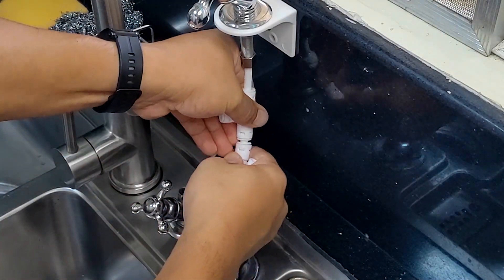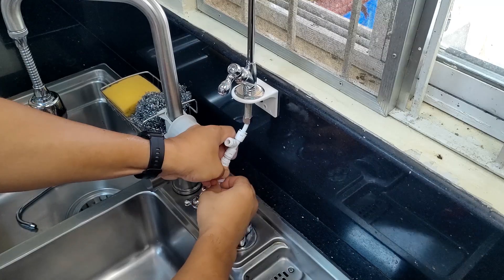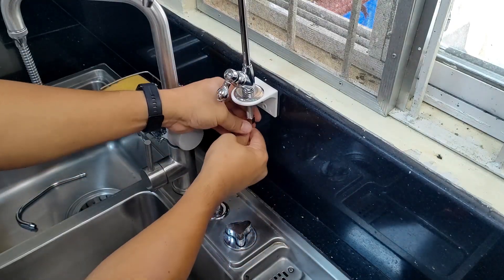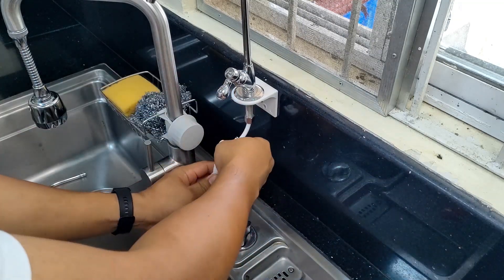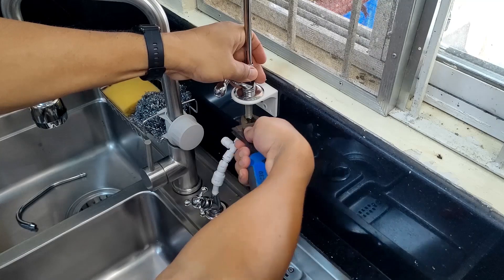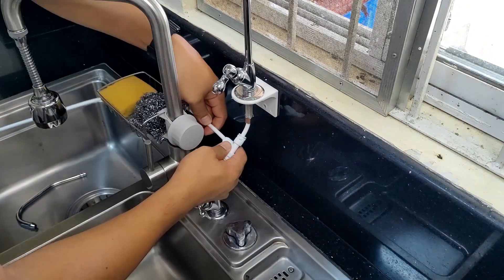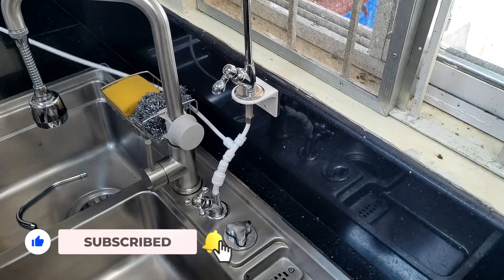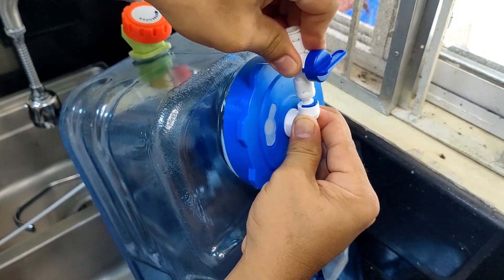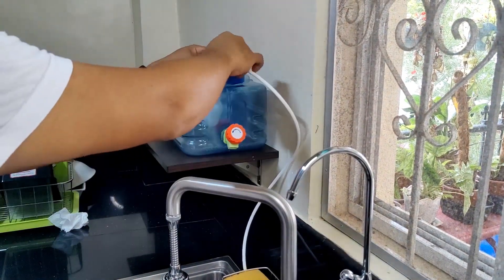Assemble quick connect fittings and start measuring the required lengths for the hoses to connect the two faucets; cut lengths accordingly. If your RO system is installed above your sink, it is not necessary to install an extra faucet since you can tap an extra hose connection directly to your original storage tank. When everything is in good position, tighten the nut of the faucet with a spanner. Measure the hose to connect the tank from the T-connector. Install the valve to the tank and fit the long hose. The new connection is now complete and the tank is ready to be filled up.